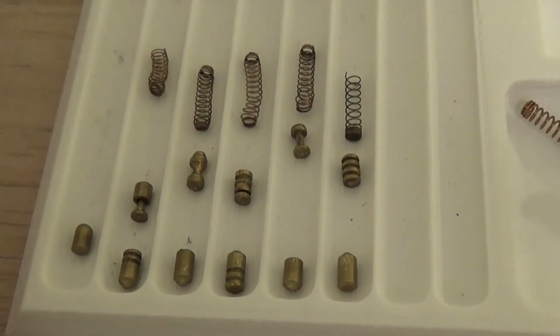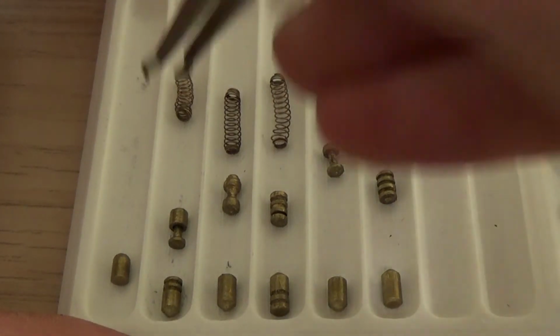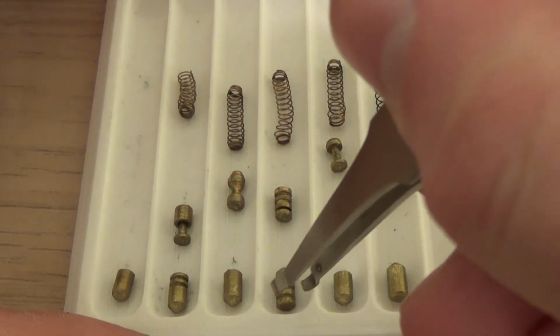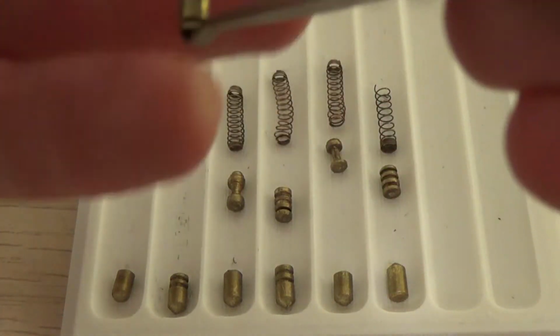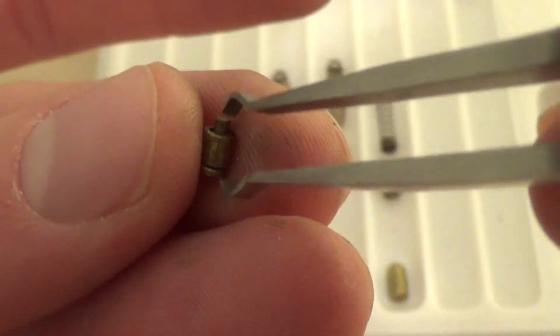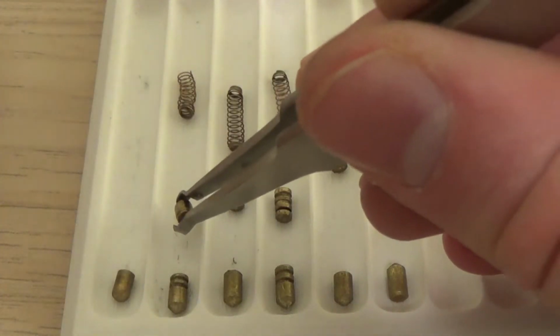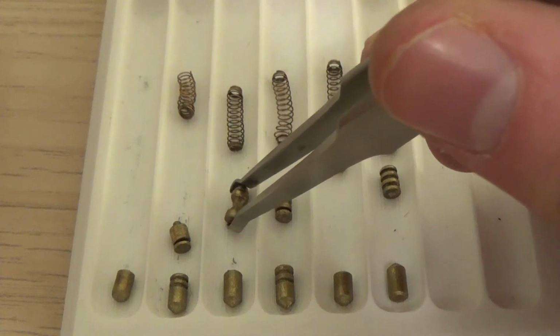Okay. The key pins, long tweezers. The key pins are fairly normal. You've got serration, all the rest are normal. Up top, number 1, I don't know what it is. Number 2 is this beautiful 2-part pin, which could have explained that really crazy false set.